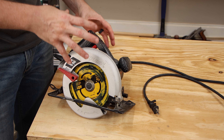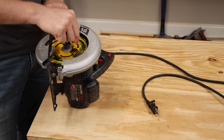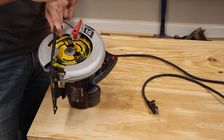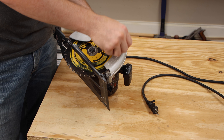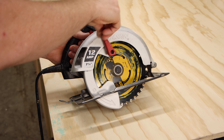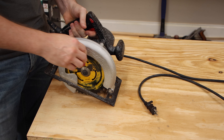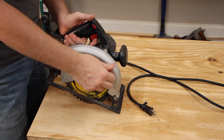The parts of the circular saw are pretty straightforward. You've got a back grip and a forward grip. The blade sits on what's called the arbor, and there's a washer and a nut that tighten the blade down. There's a spring-loaded guard that moves out of the way as you push through the cut. It also has a handle so you can manually move it out of the way if you're doing a plunge cut or a really shallow cut.